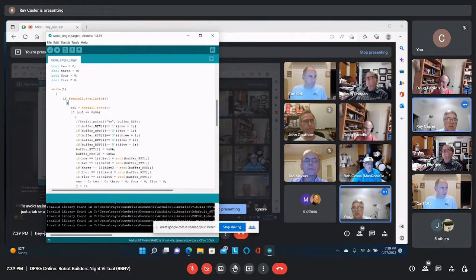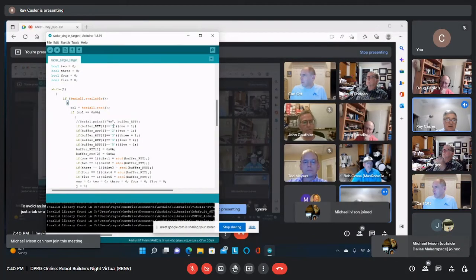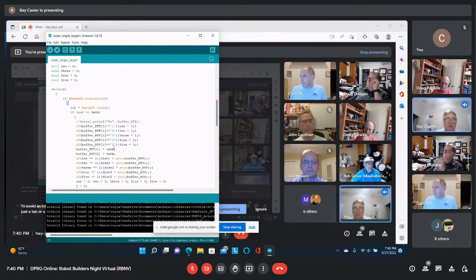So what I was doing is looking for, I think, what is 0A, a carriage return or line feed? I always forget which one's which. Carriage return, I think it's the line feed. So when I have that, that's indicated it's the end of that little string. And so I'm looking for the number 1, 2, 3, 4, 5 in it. Once I find it, those should probably be zeros, but I just put them 0A.